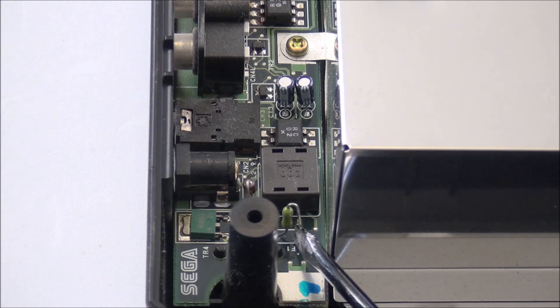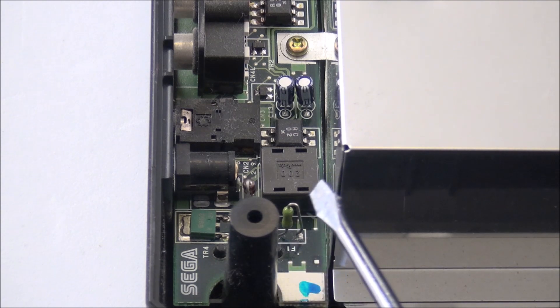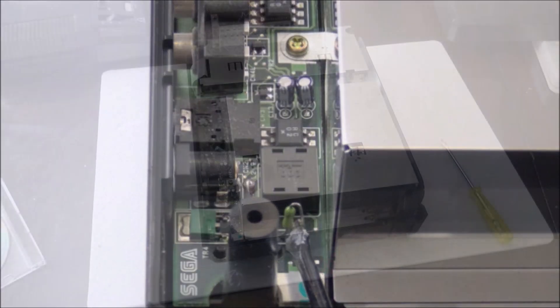This first method might be a little risky, so please proceed at your own risk. It involves using a flat-blade screwdriver — place it in between the fuse, then turn it sideways so it makes contact with the metal on both ends of where the fuse is soldered to the board. This bridges those two points together and bypasses the fuse. Be very careful not to make contact with anything else that might be metal on the Sega CD — only touch these two points, because touching anything else could cause a short and damage your Sega CD.